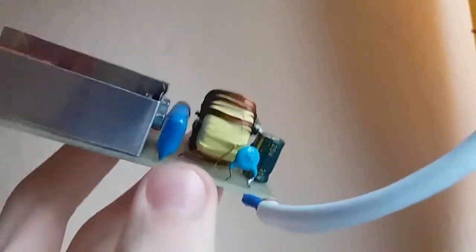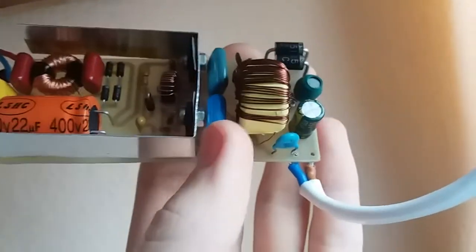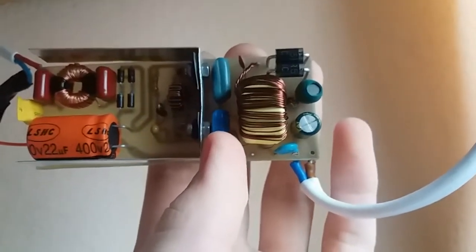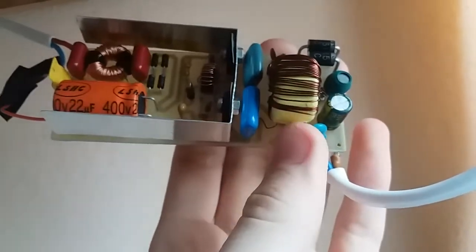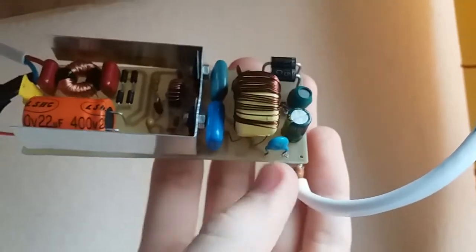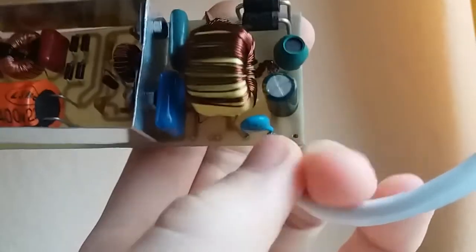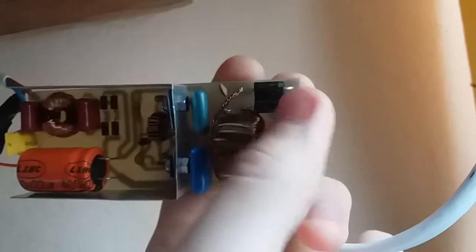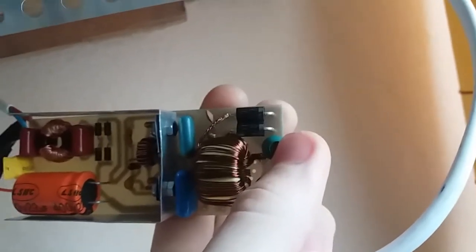This transformer I'm using now is much larger, with a little 560 pF capacitor between the secondary ground and the joint of these two half-bridge capacitors. It works fine. That node is actually quiet because it's AC coupled to the primary ground with a rather large capacitance, so it is quiet in regards to EMI. You can hook in a Y-class capacitor there, not necessarily to the primary ground. Here you can see two diodes — 5 amp, 100 volt rated — and a choke, which is not necessary here, as I'll explain.